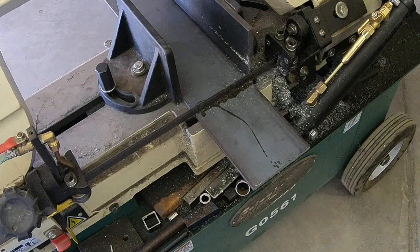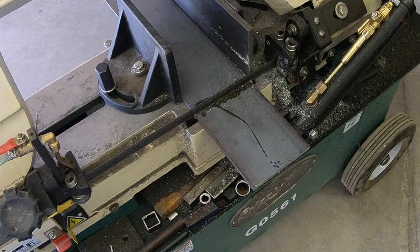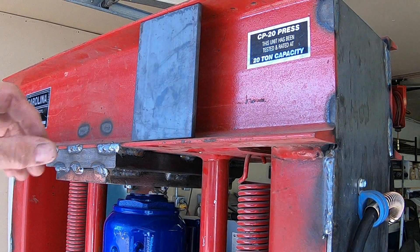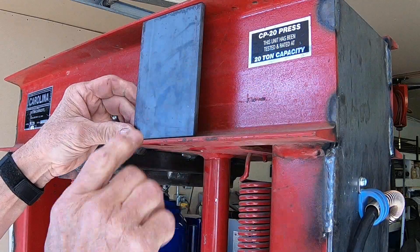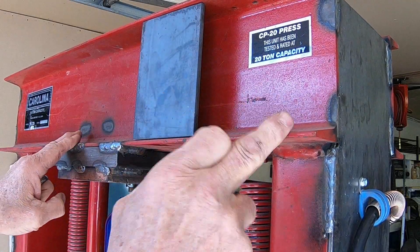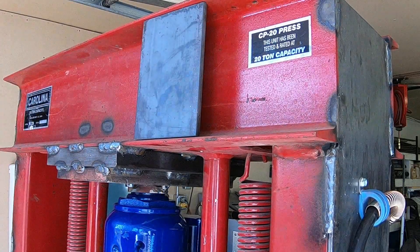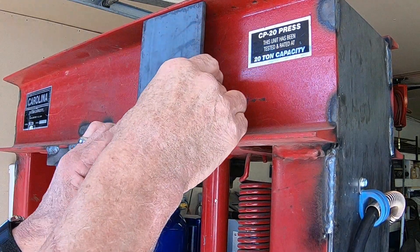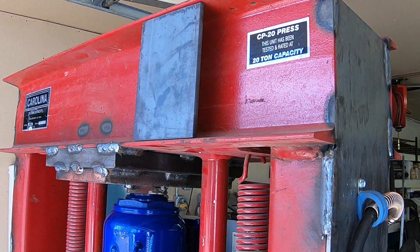It looks like if I cut these to about five and a half inches, they'll barely fit into the channel, and I'll be able to weld them so they're actually inside the channel instead of on the outside. I think this is what I'm looking for — otherwise I can just run a bead across the front of these so they're setting recessed back into the channel. I'm thinking about three of them. I'll probably start about where I'm at now, put another one here, and then one over here. I'll probably end up having to modify my little shelf up here, but I should be able to make it work.